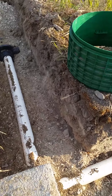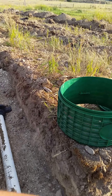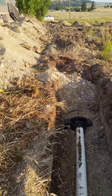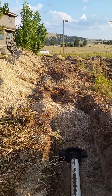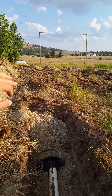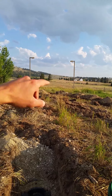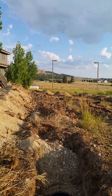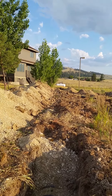The D-box — the distribution box — distributes flow down each one of our channels. We've got three channels, so I've got 42 chambers total. We just trenched them along this line, keeping them basically on that contour line following the slope of the ground. This one heads right over toward the main house's septic system, within about 20 feet.